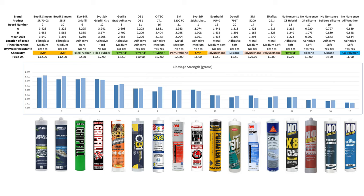Here I've stripped out the comparison products and outliers so the graph is a fairer comparison between true rival products. My conclusions: first, I've spent a full hour doing more entertaining things in my time. Second, SMP or modified polymers are excellent — Bostik's industrial range in particular. Third, there's more of a difference than I expected, and the legendary brands aren't necessarily the best; consumer-marketed ones can actually perform well at lower prices. Fourth, pretty much all top-end adhesives are a nightmare to work with and get a good finish from — very spidery and hard to smooth, so those you can sand and shape after curing are a bonus.